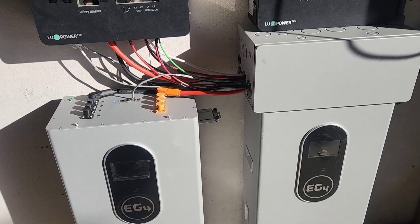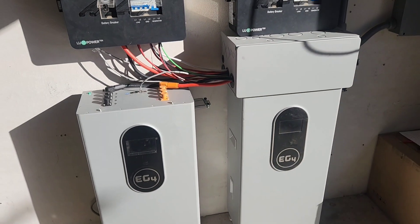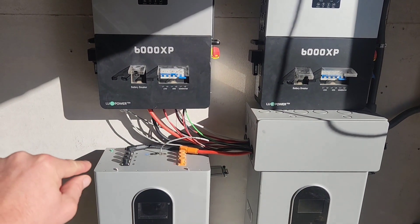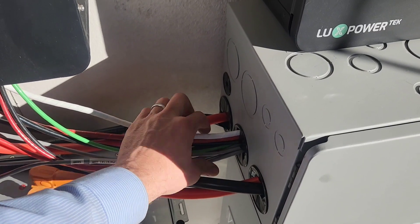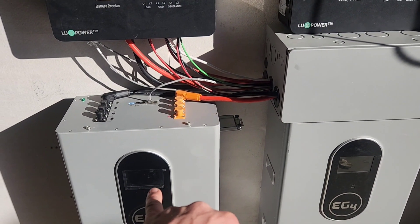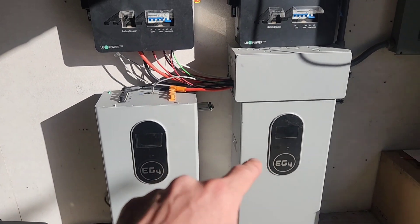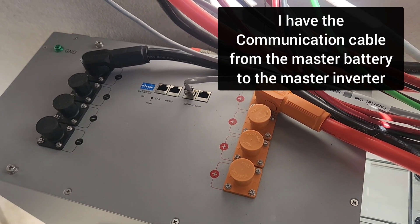Okay, I'm all connected — that was actually pretty easy. I do have to clean this up but I'll save that for a future video. I think I'm going to get a large wire trough to stretch across both batteries so I don't have to worry about the piping. This battery is just below 49% and this one is just slightly above 49%, so I made sure they were close to the same before connecting them together. In the app it's showing 48% — that's an average between the two batteries. I connected the cables right over here to the positive and negative ports, and there's an internal bus bar here.